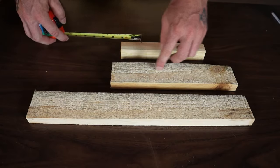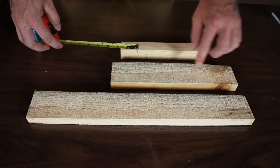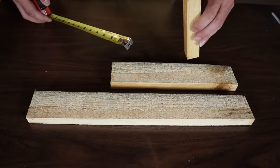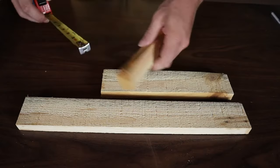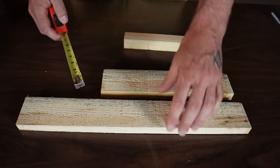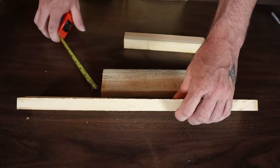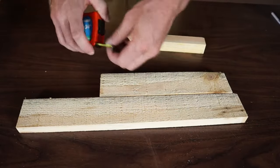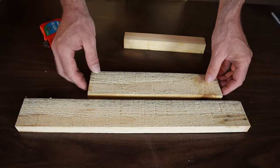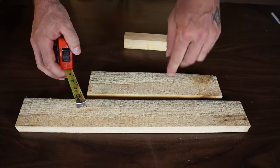If you wanted, you could probably cut a handle into the two top end pieces, but this is going to be a nice quick simple build — I'm not going to do the handles on this one. Then you're going to need four pieces at eight and a half inches — these are going to be the four corner posts. Those corner posts I've done one by one; they could be a bit smaller or bigger, that'll still work. All my slats are just over half an inch thick. I've used a spruce 4x4, ripped it and then ripped them to two and a half inches wide, and that's going to give you a nice gap between the slats. All the dimensions and instructions will be in the description below.